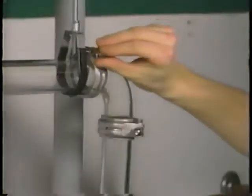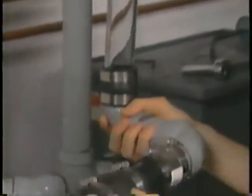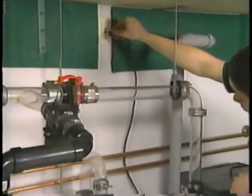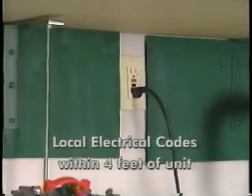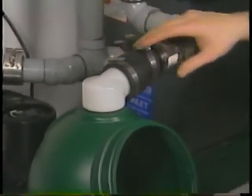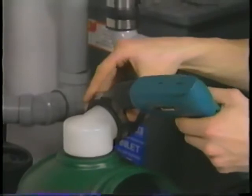The initial installation steps for all pump units are exactly the same as they are for the gravity unit, with one exception. Since Rhino pump units are electrically run, be sure there's an electrical outlet suitable to receive the grounded attachment cap from the motor. This outlet should be installed to local electrical codes and be within four feet of the unit. Connect into the piping downstream from the P-trap and direct the pipe to the top inlet on the Rhino unit, making sure the fittings are tight and secure.